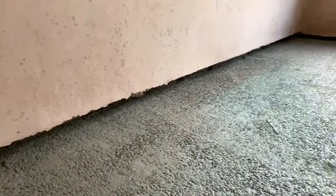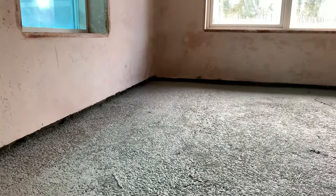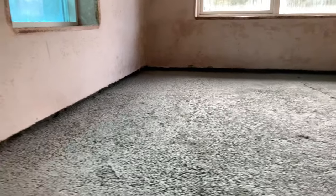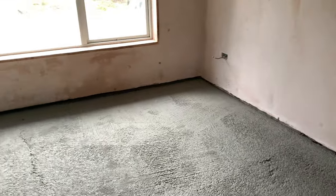And I can see straight away from this point here, you've maybe got 60-65 mil of a gap between the top of the insulation and the underside of the board. Whereas if I move down to the other wall, that's probably only about 50 mil. So you're going to have loads of gaps everywhere. So what do we do in that situation? Well, it's not a huge cavity to fill in most cases. The 100 mil is the biggest one on the outside walls.